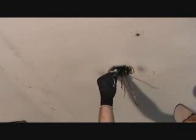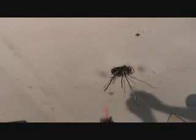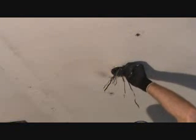If you have to, you can take a picture of it with your phone. You can write it down, and we can actually put some masking tape on here or something so we know which ones go to the light switch, which ones go to the box, the hot wires, okay? However you need to do it, look up here in the junction box. When I crawl around up in the ceiling, I'm going to know which set is hot. Okay? Got to be careful with that, don't I?